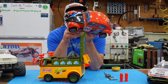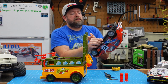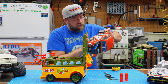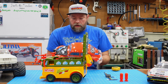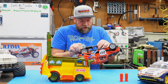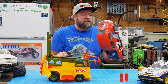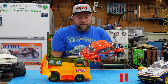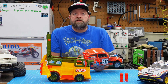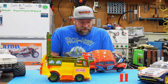The VW Beetle Rally is on an MF-01X chassis, which is an adjustable length four-wheel drive chassis where you have spacers that you can change around to change the wheelbase. The spacer blocks installed right now are 30 and 40 millimeters, so that's 70 total. I could almost just take out these two spacer blocks and I'd have the right wheelbase and could probably get this to work. But that is a little too easy and I don't always do things the easy way.